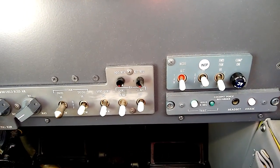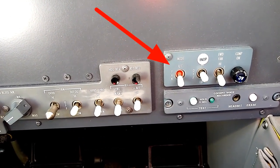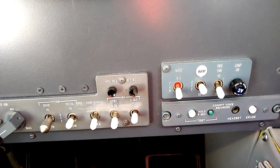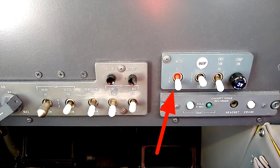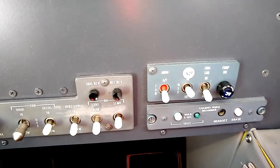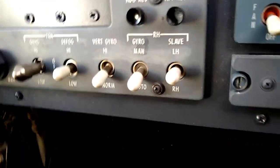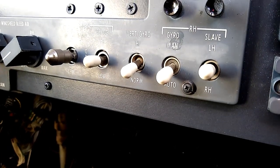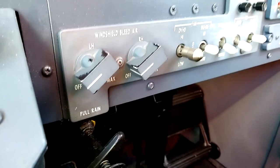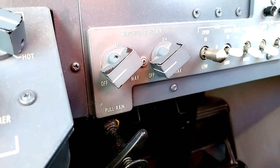Down to the switches for various systems — we've got the air conditioning control panel. In this airplane it's actually labeled inop; we've had some issues with it being worked on, so it's inop right now. But basically you want the master switch on the far left side of the air conditioning panel in the off position. Moving over to the gyros, make sure those are in the auto position. The vertical gyro should be normal, defog fan off, overhead fan off, and the windshield bleed air valve should be off. Normally the only time we open those up is if we're purging the system or operating in icing conditions.